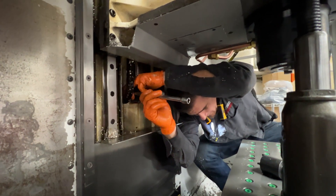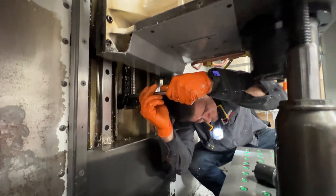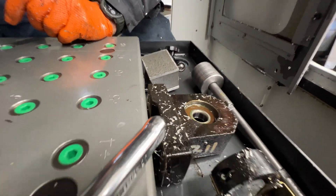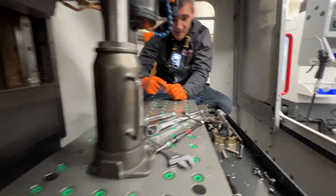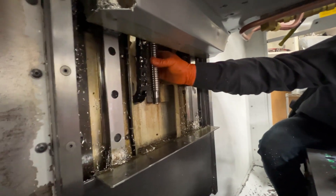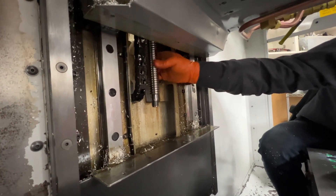So we're gonna pull the motor out. The motor is gonna come out — these are the coupling for the motor. So he just pulled out the bottom bearing. That's just support — it's the less loaded one. This ball screw feels good. It's definitely your end bearings.